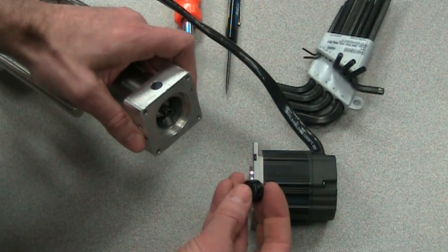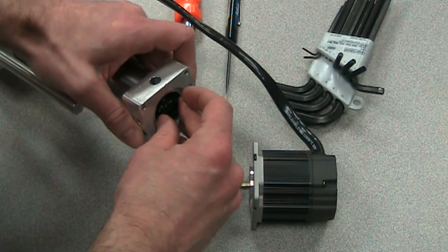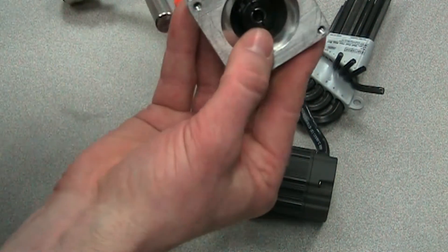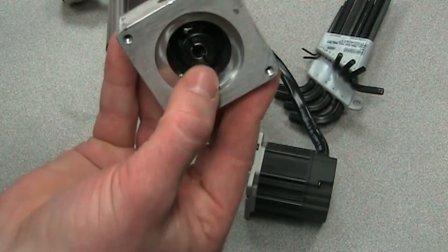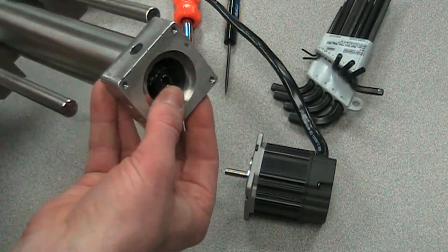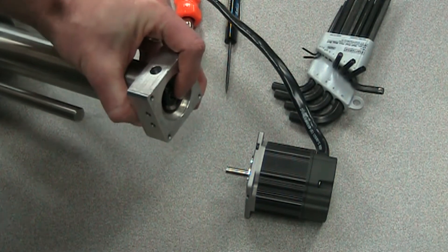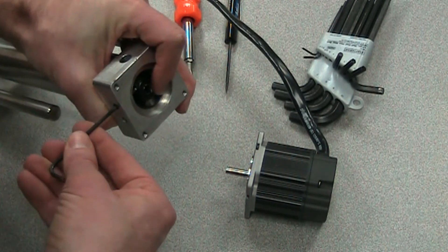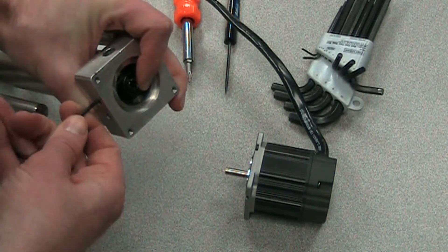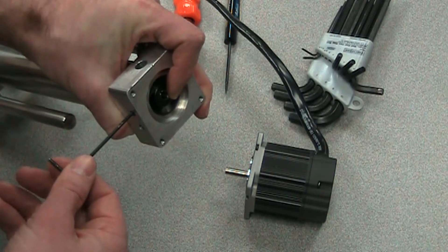What I removed here is a collar clamp that we're going to apply to the back of the actuator. We want to line up the split in the back of the actuator shaft with the collar clamp split, and get an Allen wrench lined up with the hole on the side. That's a 2.5mm Allen wrench. Put that in through that side access hole, which is used for the foot mounts. If you have a foot mount, you'll need to remove that.